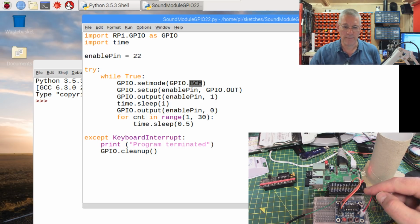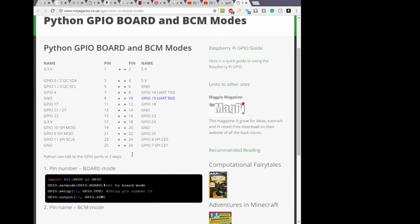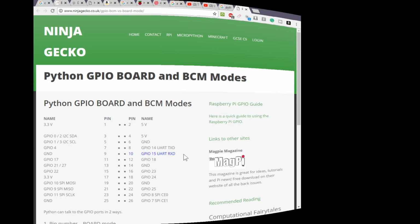In fact, there's a little web page on one of the Pi websites. I'll show you that in just a sec, exactly what we're going to be using. This is a fairly typical web page, of which there are a zillion, explaining the GPIO board and BCM modes. This is quite a nice one though, because it gives all the pins, and down the bottom it explains the difference between board mode and BCM mode, and explains that one set of numbering here and a different set here actually address the same pin. We're going to be using BCM because that does seem to be, well, I don't know if it's a de facto standard or not, but certainly in the examples I've seen so far, it makes sense to use those. So that's what we're going to end up with. If anybody knows different, do leave a comment below. We'll revisit this entire subject. I'll put a link to this page in the video description so you can have a good look at it. So that's what we're using.